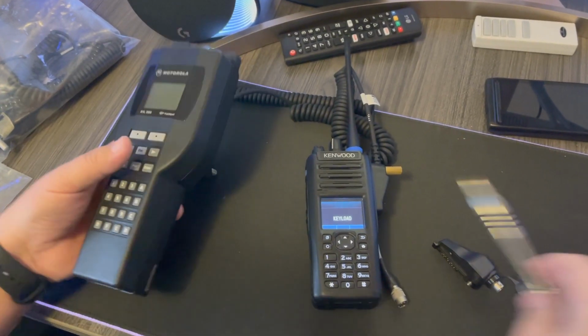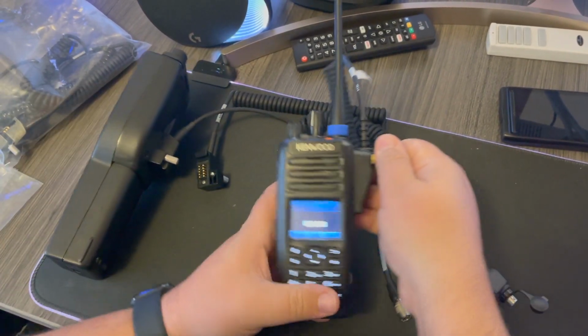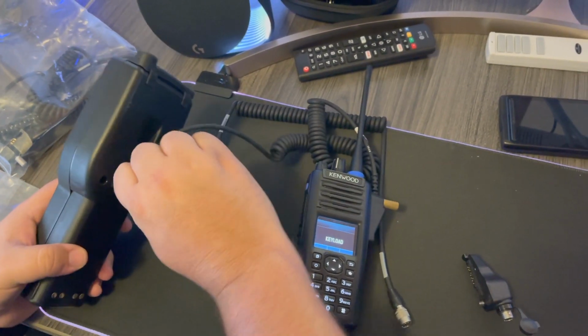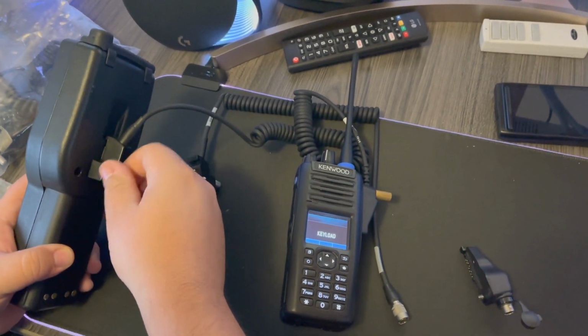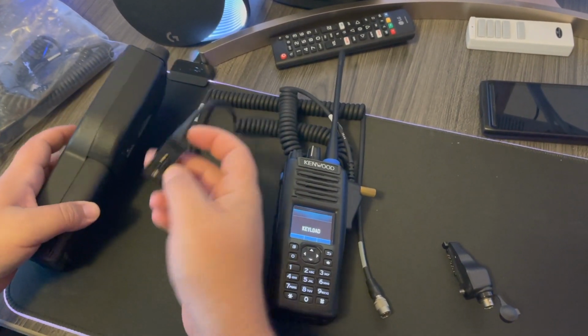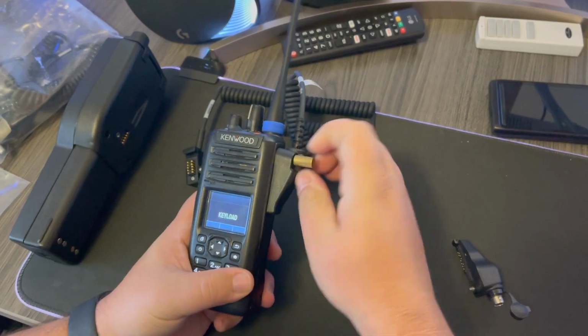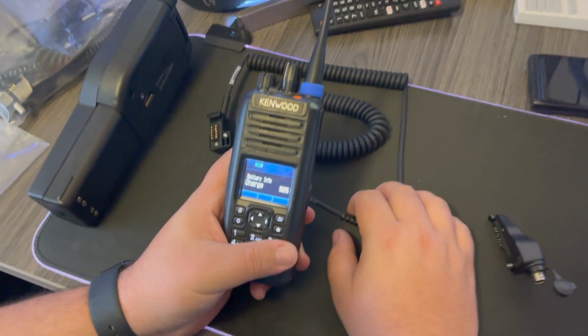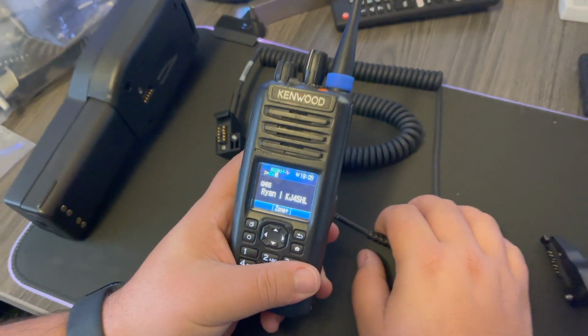Now, if you do me one thing, take the cable off the KVL. No, off the KVL. The KVL? Yeah, I want to see if it exits keyload mode when you remove it from the KVL. Yeah, it should. It does not. It's 2 pins in there. Let's take it out of here. Yeah, it reboots the radio. Yeah, there you go. Okay.